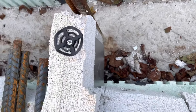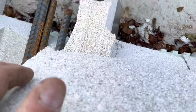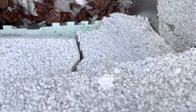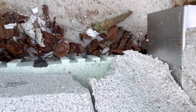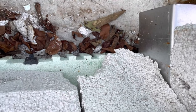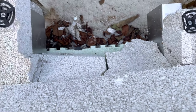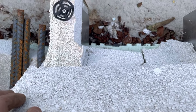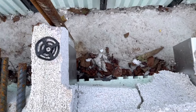Before I carried these in, I cut the light deck — the foam part of it — back, carried them in, and they just rest on the ICF. You can see the ICF down there — I call it green, some people call it blue. They're just resting by gravity; I did not mechanically fasten them in any way. I left the steel channels as long as I could so they can be well embedded in the concrete.